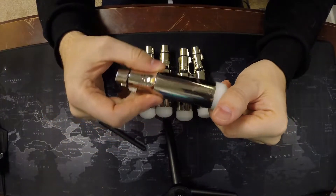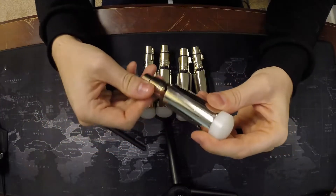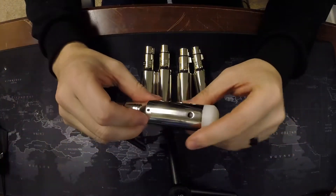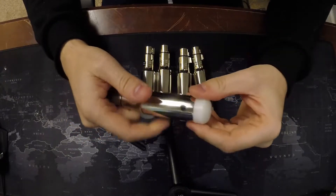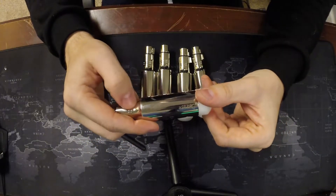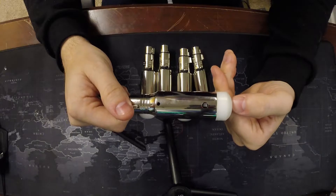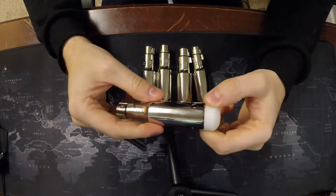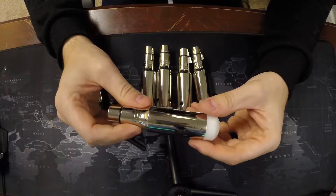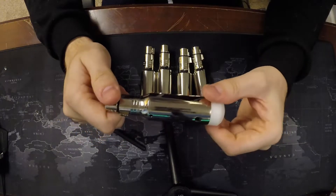One of our worries with wireless DMX was longevity — can I connect these up at a wedding, test the lighting, leave them on, and will they work throughout the entire gig? According to the manufacturer, these have an eight-hour battery life when fully charged, and I've experienced close to eight hours myself. We try to be conservative: we kick them on, test everything out, then turn the receivers back off until we're ready to start the gig. Most weddings are four to five hours, so these last more than long enough.